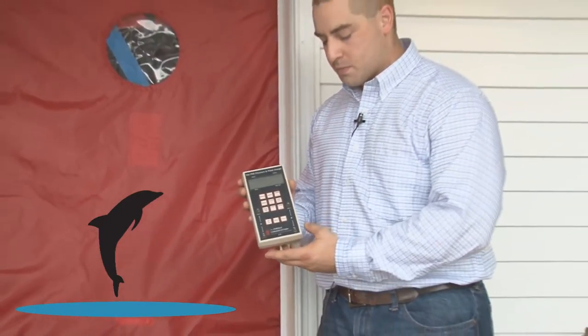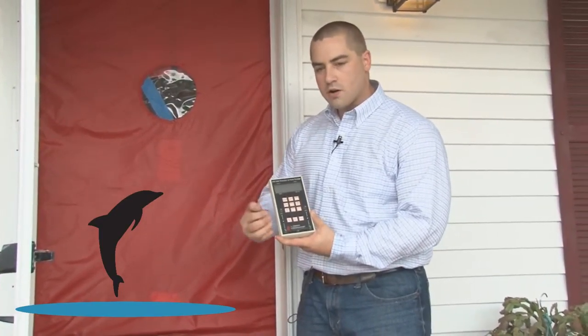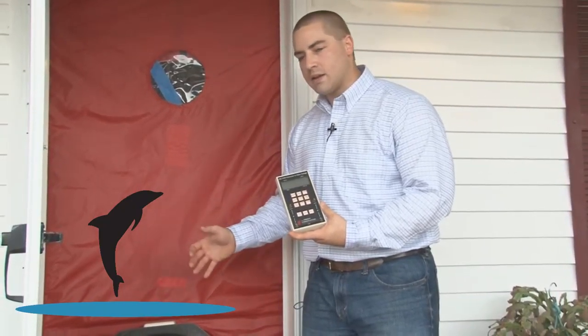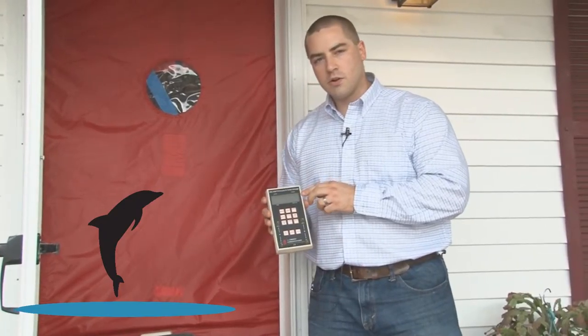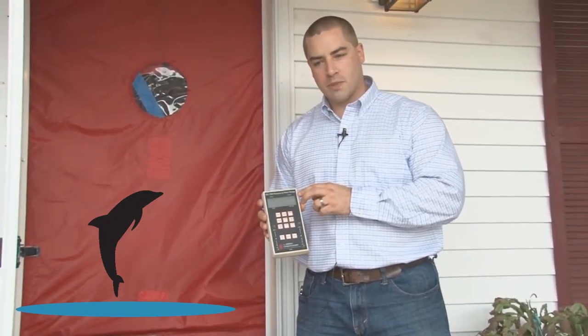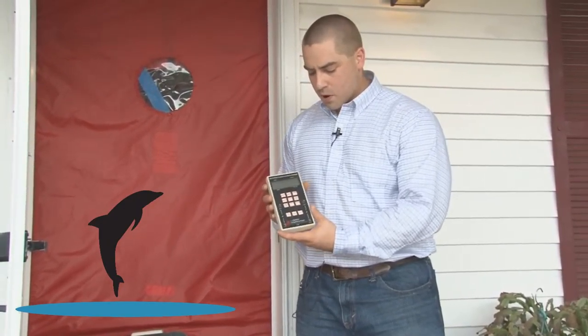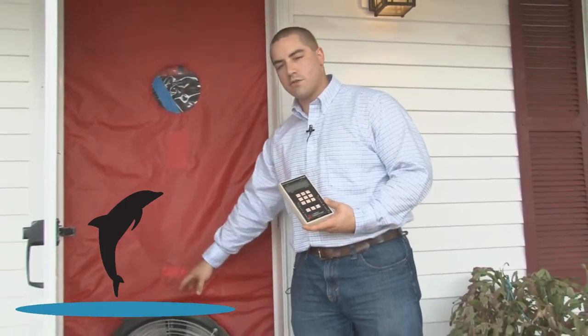This particular one is made by a manufacturer to match this blower door, and it also has a little miniature computer which automatically makes adjustments. So the display that we're able to read will read out in cubic feet per minute. We also have these hoses which are able to get us references from outside to the inside and also the fan.